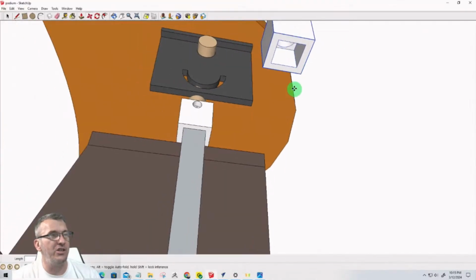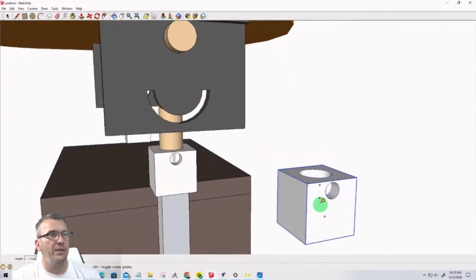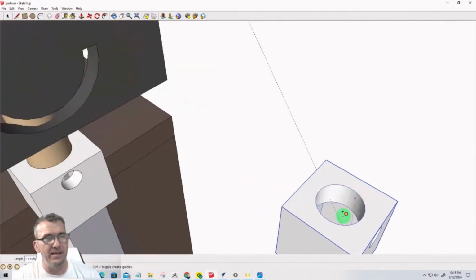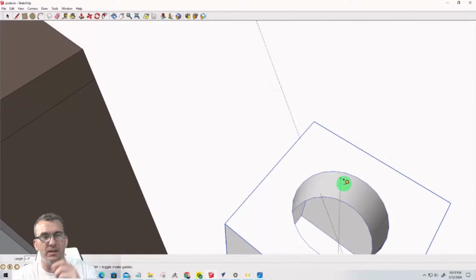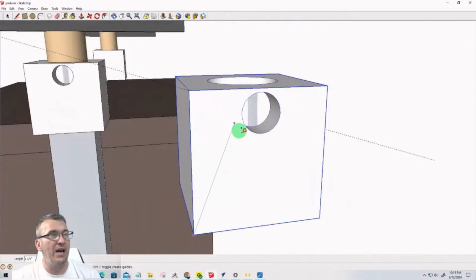And then, the transition, so that pocket cut comes in. Let's see, get a tape measure. I've got it pocketing in 1 inch deep. The overall height of this is 1.5 inches tall. And so that means that this inner circle where the rod glides in and out is an inch and a 1/2 inch. So 1.5 inches, right?